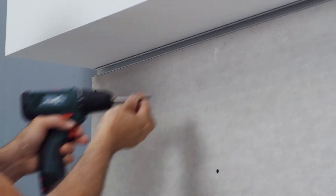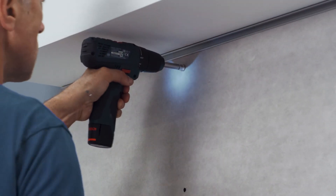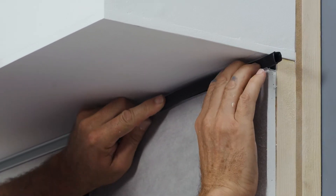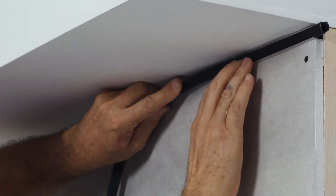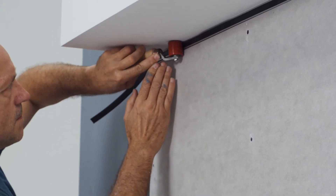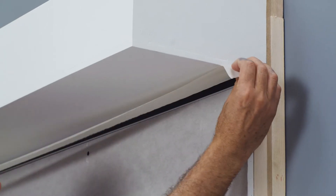Use a drill that is suitable for aluminium. Now the drywall is screwed to the support structure on the underside before spackling. To prevent contamination from getting into the aluminium profile during assembly, the robust protective cover made of soft PVC can be clicked into place.